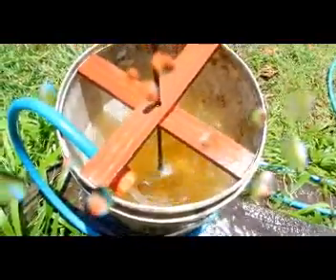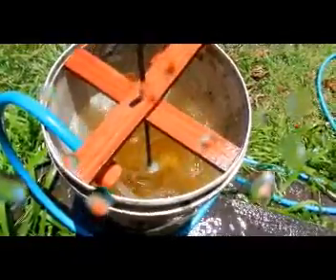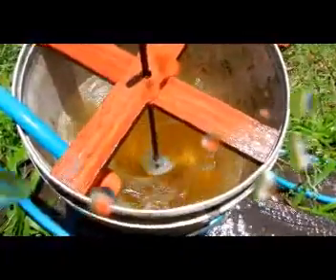If you can imagine that turbine — that rotor, that shaft — made 10 times as big, with a stream of water going through it, you've got actually significant power. As Victor said, it's the speed of the water, not the pressure. And that water's running pretty fast — it's creating a whirlpool. I'm just moving the bucket over the edge of the steps as a bit of a gate valve. I can adjust the bucket over the step and it will increase the amount going out the bottom. So I'm just trying to tune it so that it's moving at maximum efficiency. It's spinning quite well now.